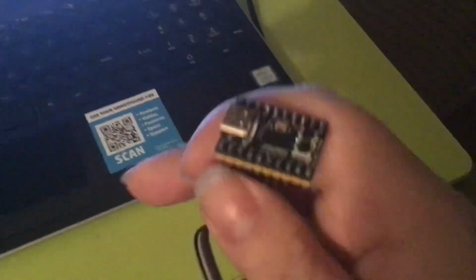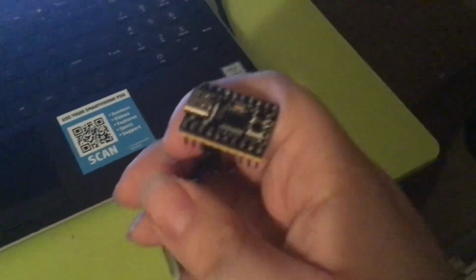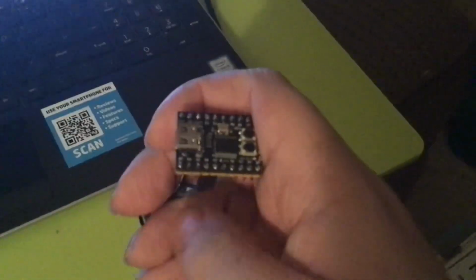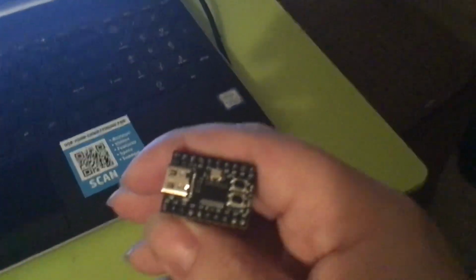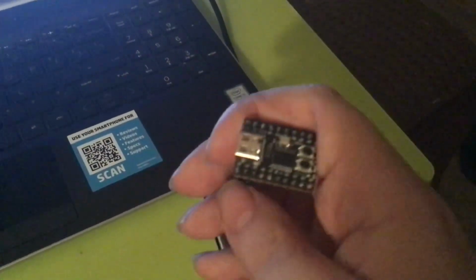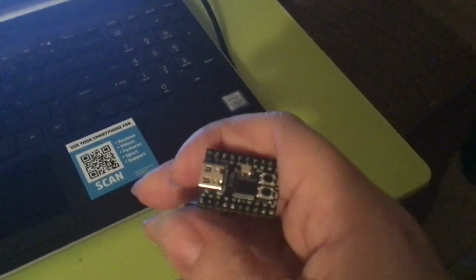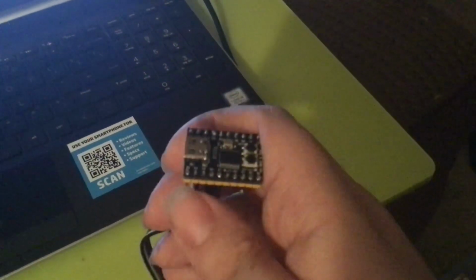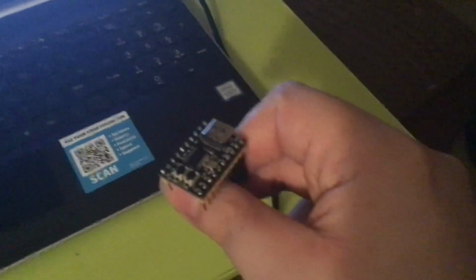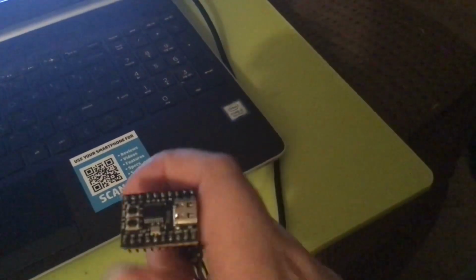And now for the two unique quirks of this controller. The first one being, for example, the ESP32 and ARM processors, and AVR chips with a bootloader on them, you can program them using the first serial port on these, UART, as long as you enter program mode and have proper software that supports it. But this uses UART1, the second port, not UART0. This uses the second port to program. And there is the second quirk of this controller and only this controller, and maybe some other ones that are similar to it.